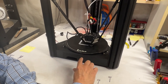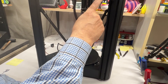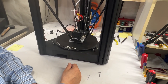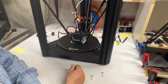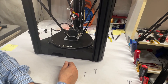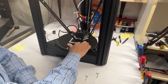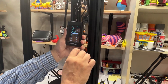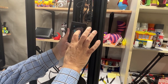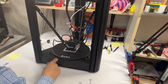You can see it's printing the square. As soon as it moves away a little bit I'm going to feel it — if it's rough, that means the nozzle is too close to the bed and I'll raise it. If it's too high, you'll see it not adhering to the bed properly. It's looking very good right now, but it's maybe a little rough so I'm going to raise it — hit Adjust Z and go up 0.05, maybe twice.